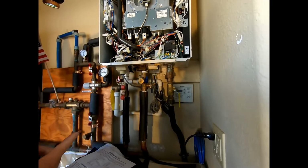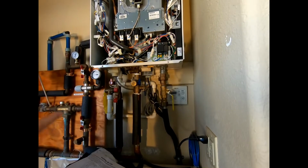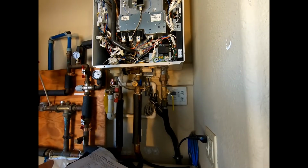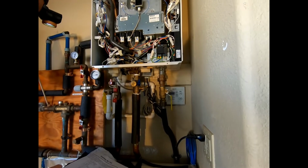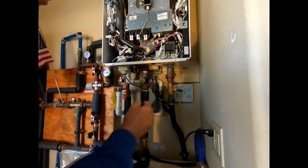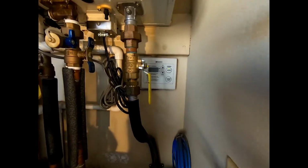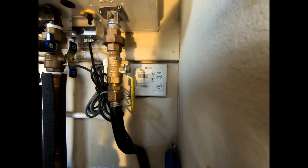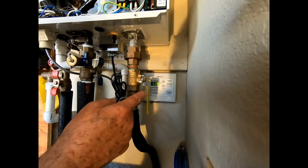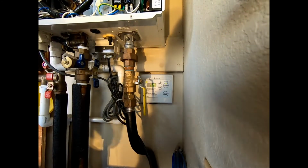You heard that? That's the fan motor coming on, and the gas valve unit cycles on off every 2 seconds. You hear it? That means the reset procedure is complete. Now, we turn the unit back on. Remember before we had it flashing and 92 was showing? Now it's not flashing and it's reset. The computer's been reset.